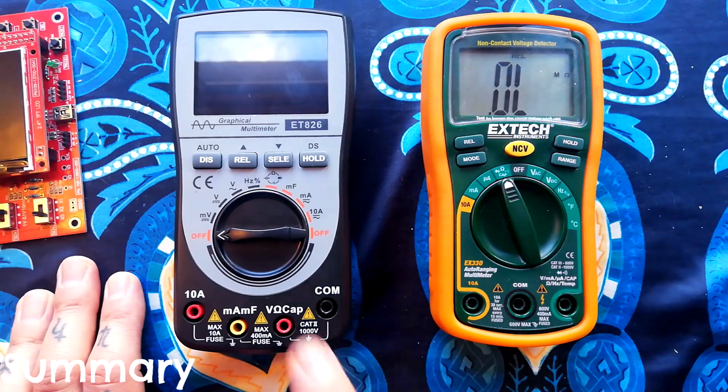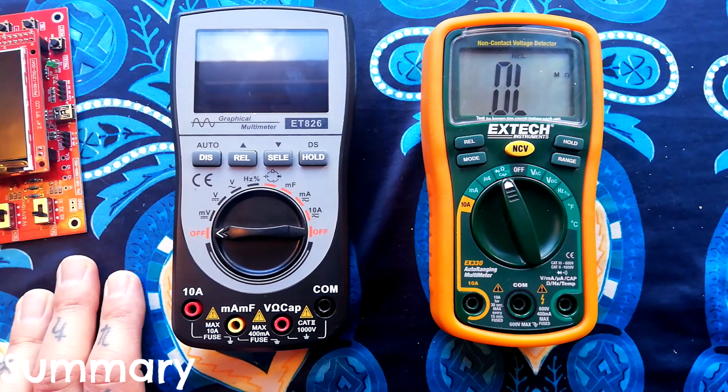My closing advice is if you can get this really cheap, great, but unless you're dealing with much higher voltage applications than I am, tube amps it would work fine for, I think. Because it's meant to deal with up to 600 volts, and I guess voltage swing on a tube amp's up to 300, but for hi-fi equipment, that kind of thing, forget about it. It's not really a good solution.